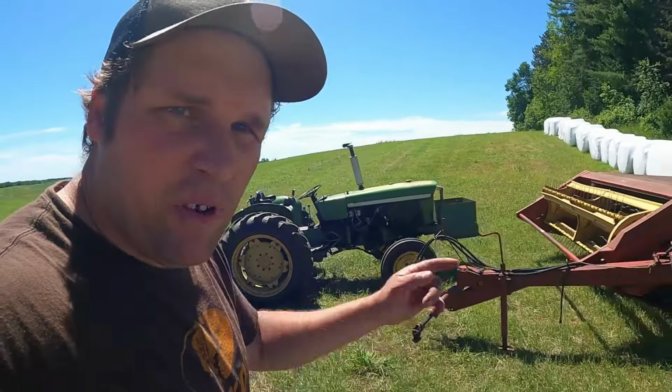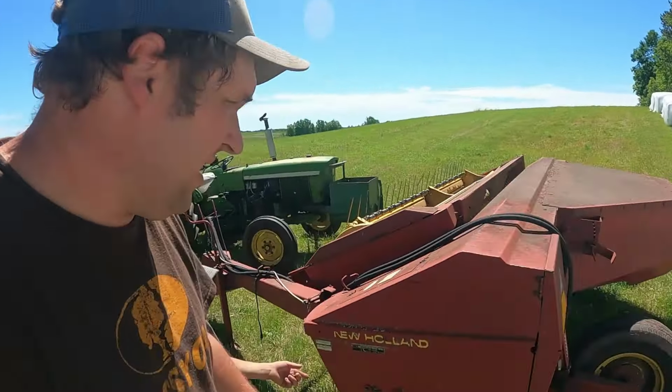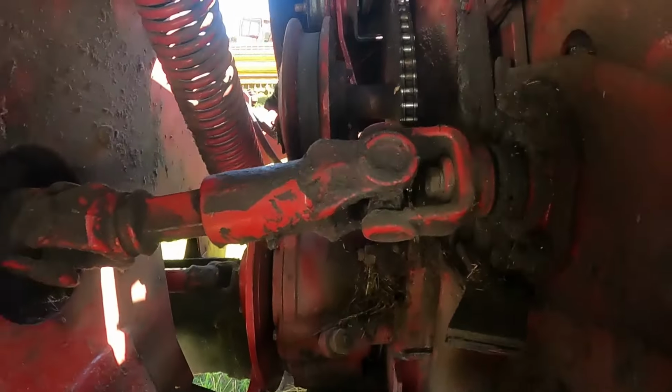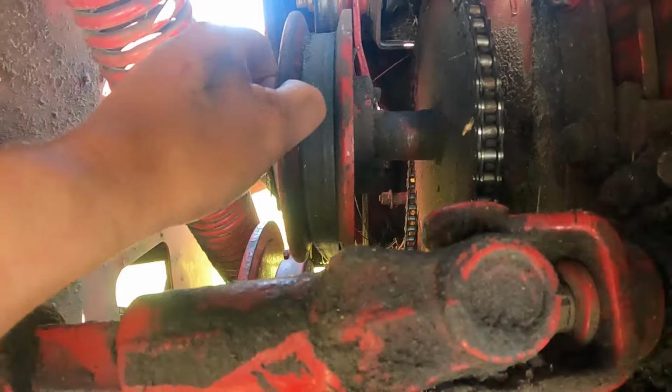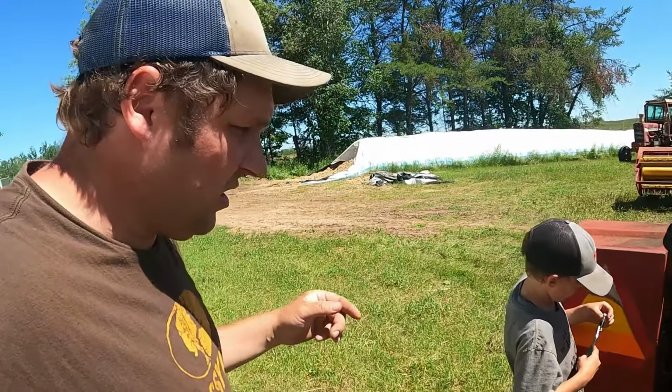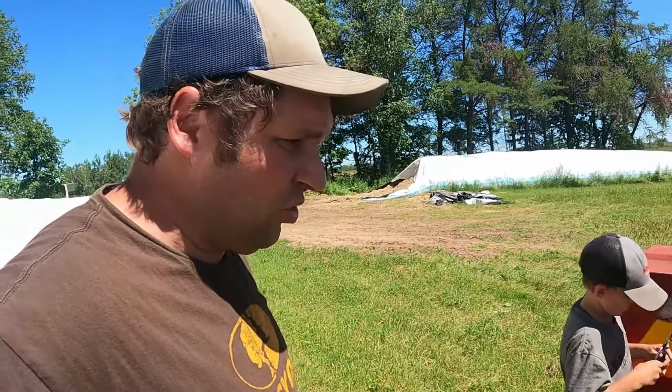It's hard to tell when you're not running them both at the same time, but this one with the shoes, it's got 5 holes in the shoes and it's at four. I guess it ain't too much different. They're probably sitting about the same. But I'm gonna tighten that outside belt a little bit more and lower those shoes down, and then we'll try it again.